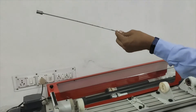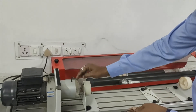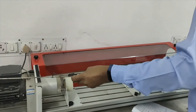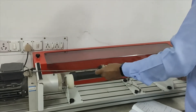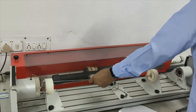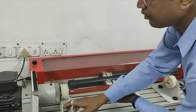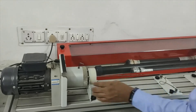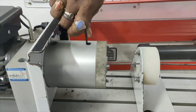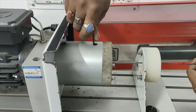This is the 3mm diameter shaft with length 900mm. To fix the shaft: inside the coupling there is a bearing, and on that bearing there is a grub screw. We insert the shaft through the nylon bush, fix it, and insert it on the other side through the nylon bushing into the slot. Once inserted into the slot, we tighten it firmly — otherwise while giving speed, the shaft may come out or get bent. We tighten it properly using a spanner.